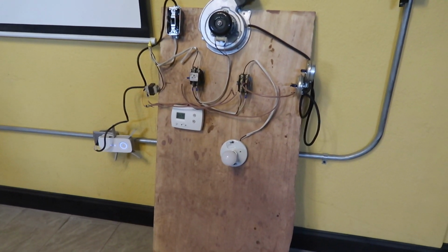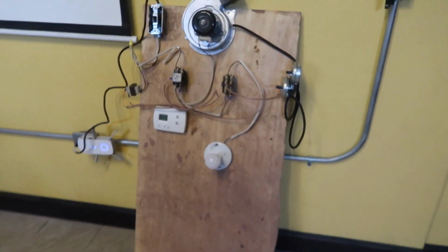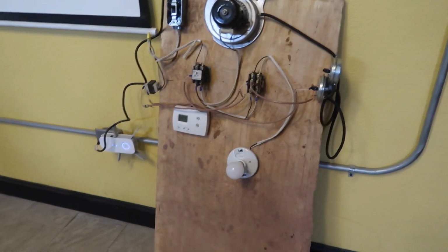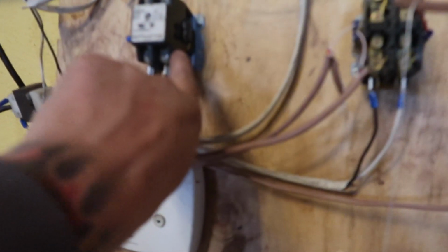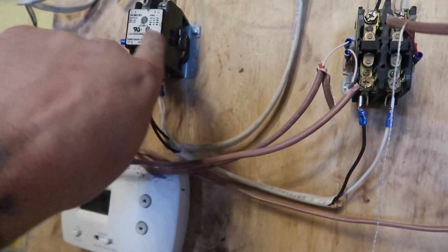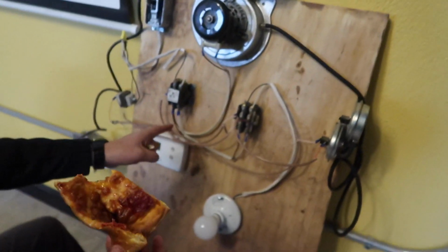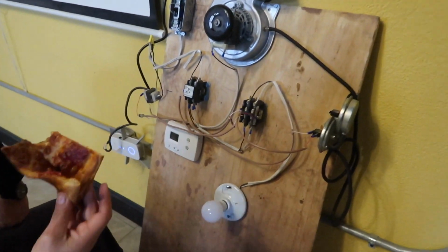I did mess up though. That wasn't the thermostat, that was the technician. I messed up. I see what I messed up. Well, he sees what he messed up, but he doesn't fix it yet. I'm about to see. Look at the diagram right now. What I messed up on is 24 volts. There's no 24 volts to this coil, so I'm gonna put another wire. That's what I was trying to tell you earlier, but you wasn't listening. No, I'm telling you. Earlier I was like, how is that gonna get activated? That's what I was asking you earlier.